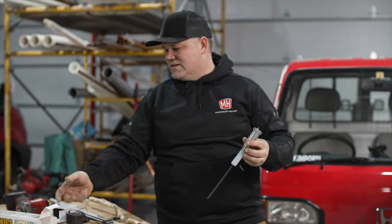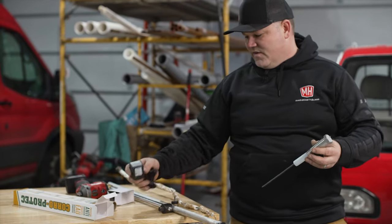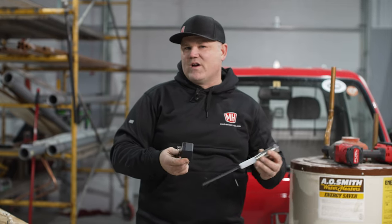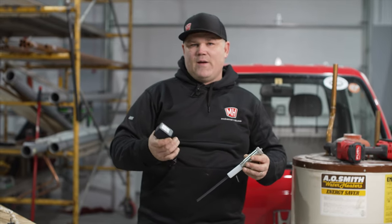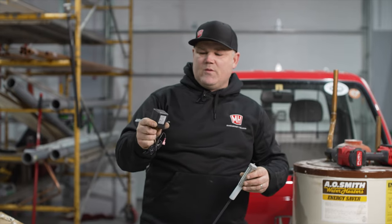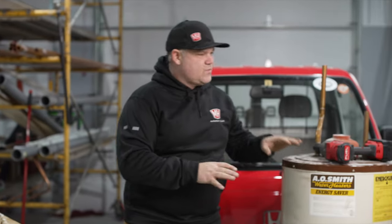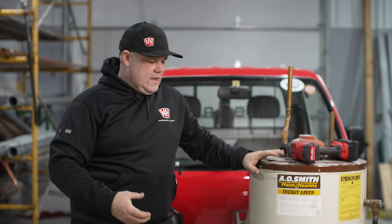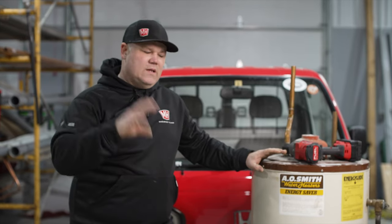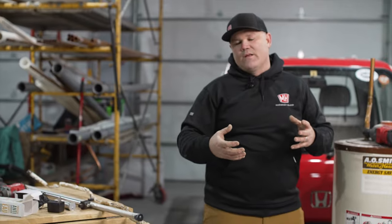This isn't a commercial for this brand — however, I'm not hiding it, I think it's a great brand. They aren't sponsoring this video. This kit is going to cost right around $125 to $150. I think you can even buy them on Amazon. I buy them from one of my suppliers here locally, but very simple — you just need to be able to plug this in, and it's got about a 12-foot cord. A powered anode rod will also protect against lime scale. It won't eliminate it entirely, but that current running through the rod is going to cut down on the lime scale buildup.